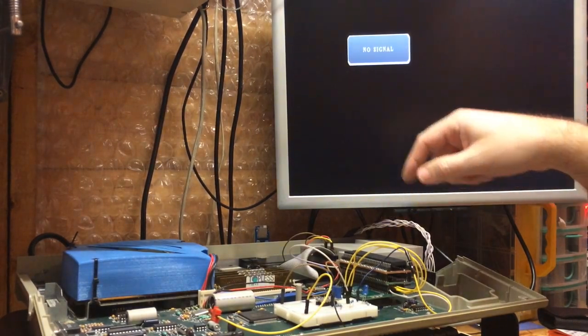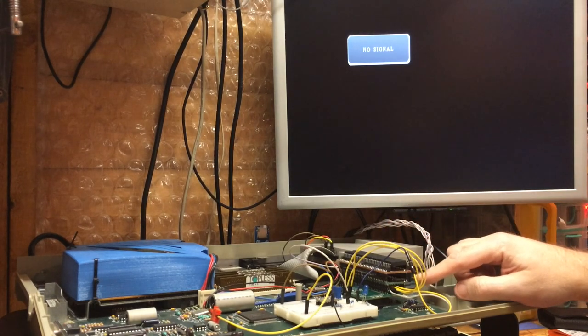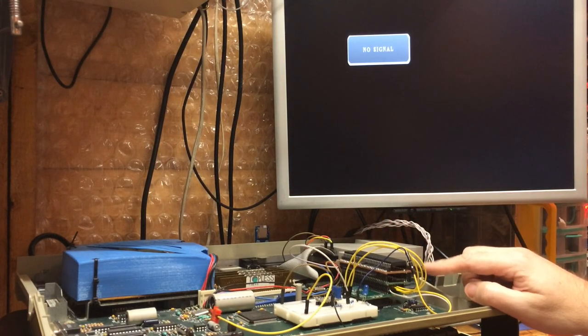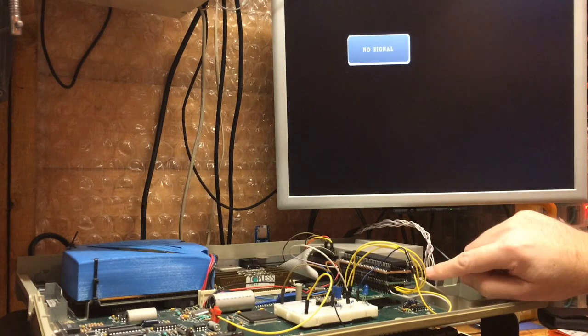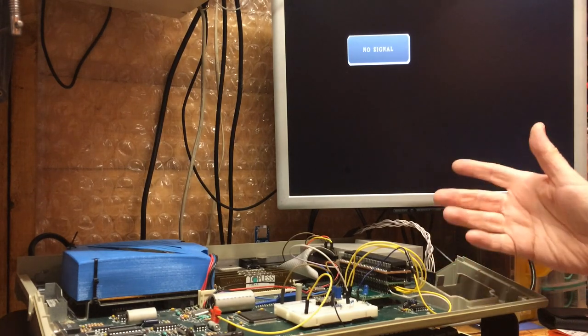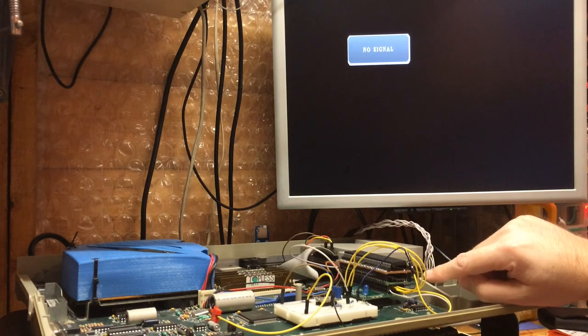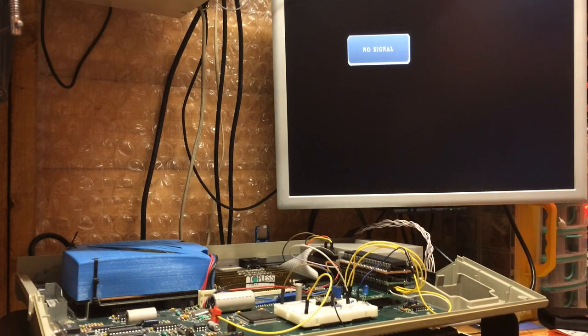So we are switching up to provide the 16 megahertz booster, and we've got ourselves 8 megabytes. That's actually a 16 megabyte SDRAM chip on there, but I'm only using 8 of it. In production it will obviously be 8. It could in theory add another 2 megabytes because you can have 10 megabytes of AltRAM. So it's got 8 megabytes of AltRAM, and it switches to 16 megahertz.